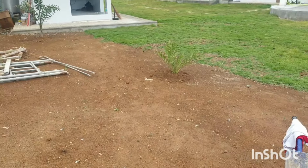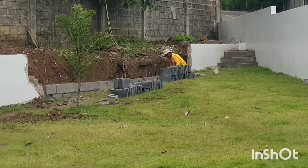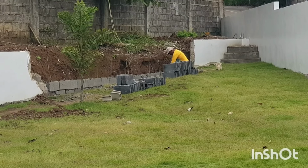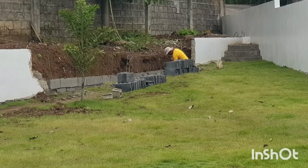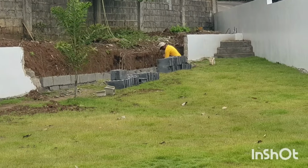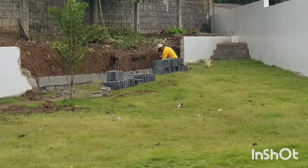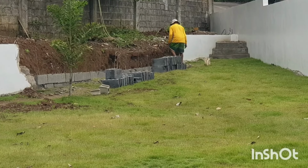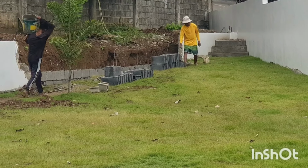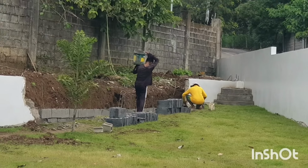These two guys. Here he is, busy laying my second row of blocks. Then we're going to have a reinforcing bar, another layer of blocks, reinforcing bar, another layer. We're going to have 3 reinforcing bars, one each layer, or maybe one on the first, miss the second, and one on the third. That's probably strong enough, because you've got them horizontal as well, vertical as well.